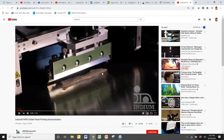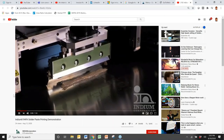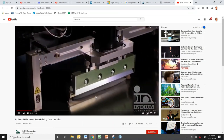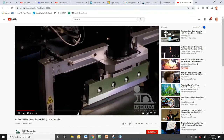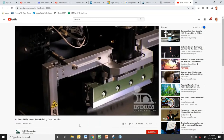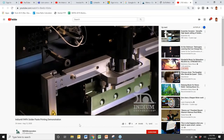All right, we dispense paste on the board. Here comes the first pass. You'll notice it's back to front, so we can see that rolling. And you saw maybe a few bubbles that just came out. Beautiful, beautiful. See that paste dropped right off? You can't see it very well from this direction, but right now in this video, the board is shuttling out, a new one is coming in, the alignment is happening, and in another moment, you should see, there we go.